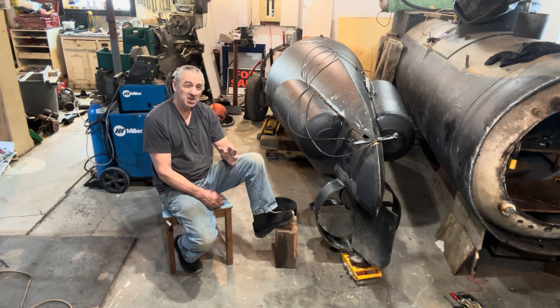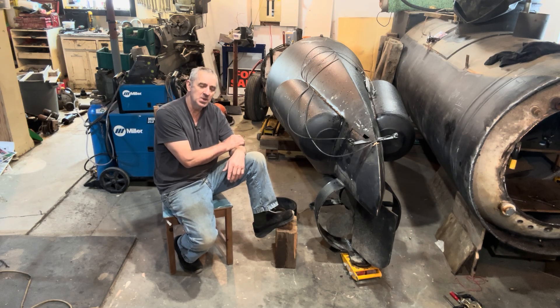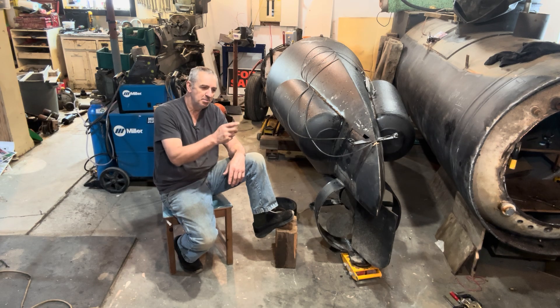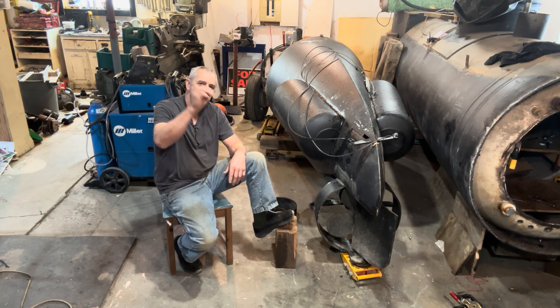Besides, I got a feeling that the old way might have leaked. This is better. Right now I've got the casting resin curing to seal it. I put solid copper wires through and put a little bend in them so that they can't pull on the epoxy. So pretty productive day, but I'm going to call it quits because I am pooped. Ciao for today.